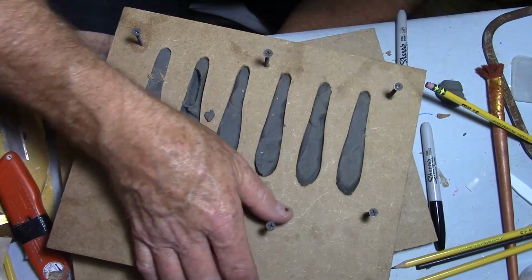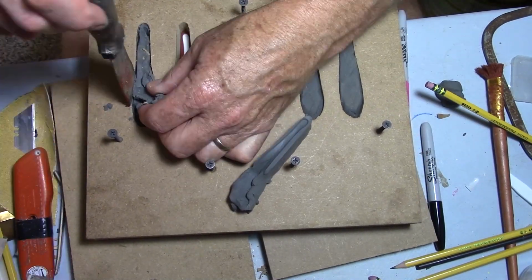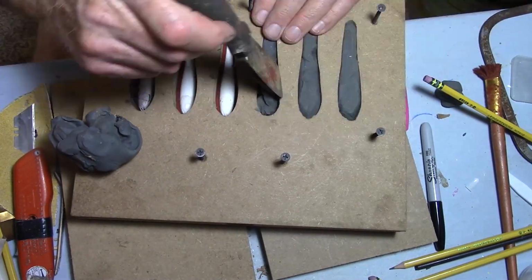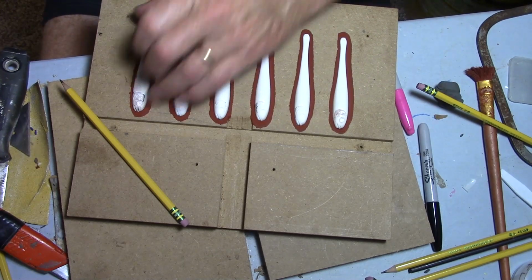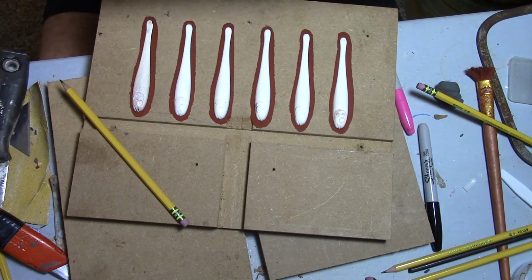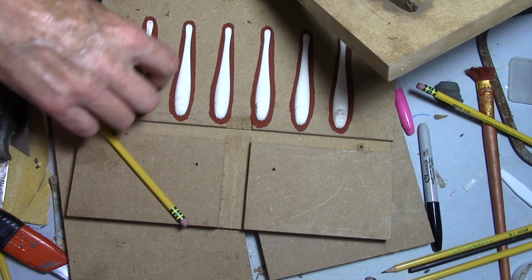And then also, when it's time to take the parts out, I recommend trying to remove the clay without disturbing the part from the rubber, because you could lose your seat. Make sure all the clay's off of these. Make sure that the corners are good and clean. Sometimes they'll look clean, like here, there's actually rubber. You got to make sure that rubber's out of there.